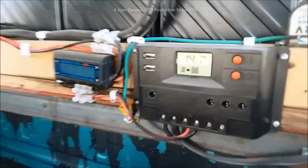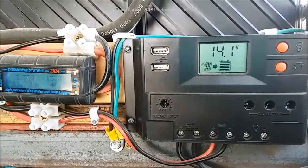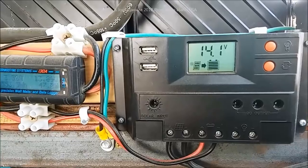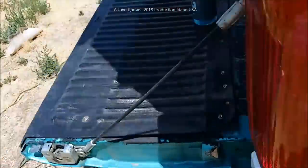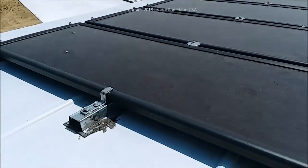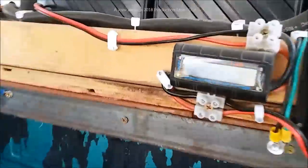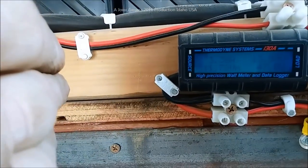The battery voltage is at 14.1 volts - the controller is designed to run at that, it's putting out fine, the controller has not failed, there haven't been any issues. And think about that with these dirty dirty panels. Let me get up here and show you what I mean when I say dirty - I mean dirty, very filthy, just trash, a heavy layer of dust and bird droppings on them, and the panels continue to produce at that rate.